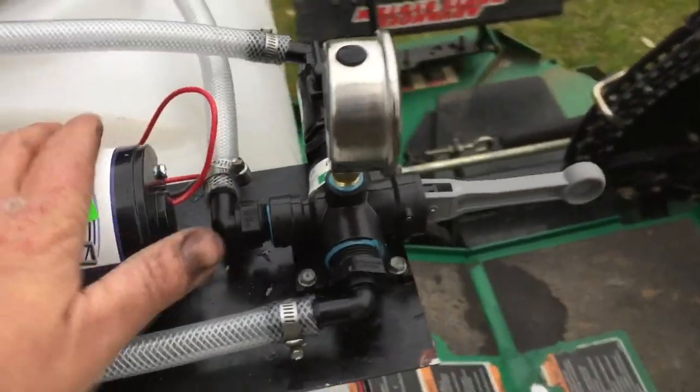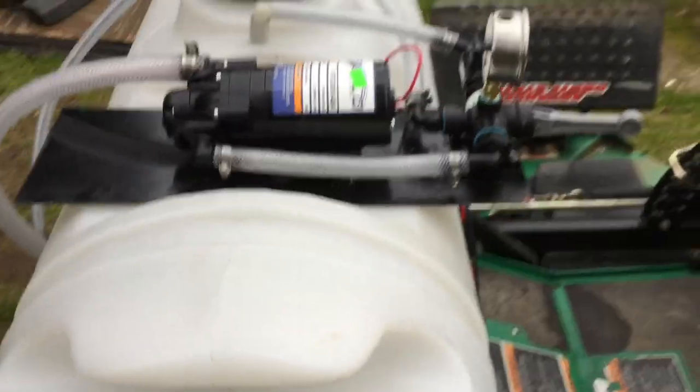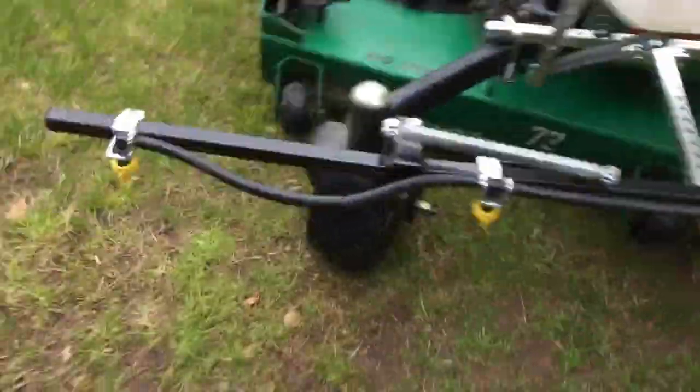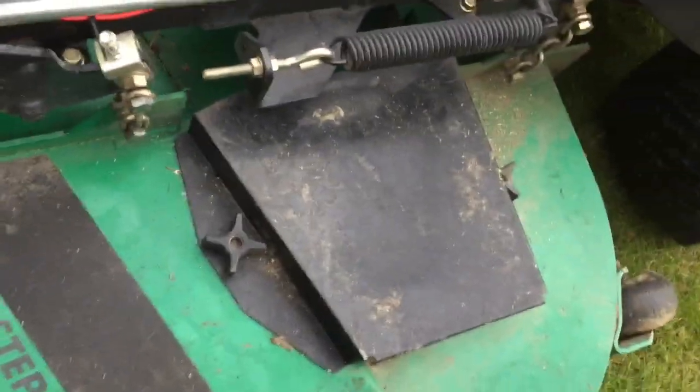There's the pump and the shutoff valve, and there's a pressure gauge on it. You use this little deal here to regulate how much return you're giving, and that'll increase or decrease your spray pressure - but that's also your agitator for the tank. It's got little quick-release nozzles on it, and some air-ejected T-jets. It folds up a little bit more so I can get it in the trailer, and plus if you hit something it'll break back like that - pretty slick.